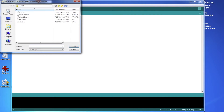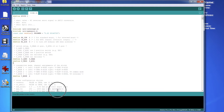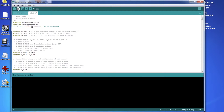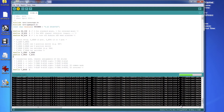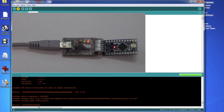Next, add a sketch file. Download the latest version of the Miru mod — at the time of this video it's 022. Open up the sketch and this is where you edit the switches for your transmitter. I'm using a DX6i so I'm using that setting. If you have a DX7 you would use that, and for any other transmitter just play around with the options. Here, SLand is the landing switch — I'm going to use the gear switch on the DX6i, and the flight mode will be auxiliary 1. There are other settings you can modify, but that's pretty much all you need to change to get going. Then hit upload — it will compile your sketch and send it to the Arduino Pro. You can see it uploading as the lights blink really quickly.